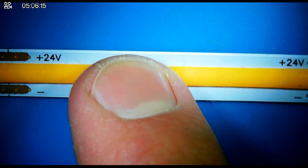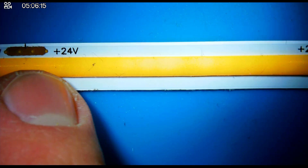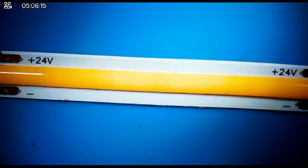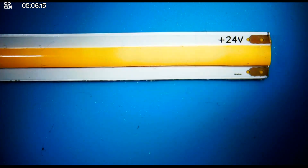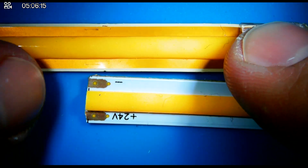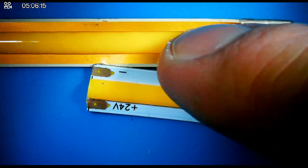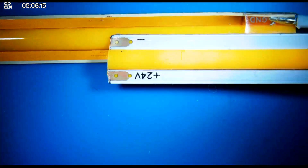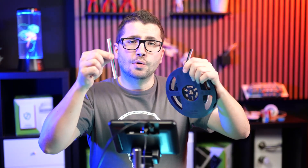When mounted in an aluminum profile with a cover on it, you would still be able to see the dots with a regular strip, which is not so nice. But this is only a problem if you see the LED strip directly — not so much if it's indirect lighting, like shining onto the ceiling and reflecting from there. Also, you cannot cut the strips anywhere you want, so when planning a project take care that you might end up with a blind few centimeters at the end. I found a super nice strip which can be cut anywhere — also COB with lots of lights — but they are much more expensive.